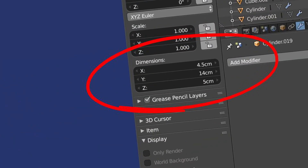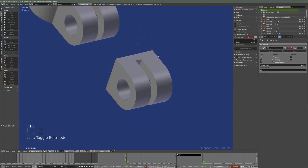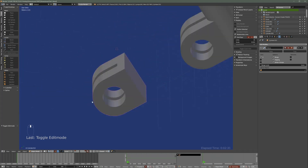I went back and double-checked in Blender — it's 140mm. And when I checked in Cura 3.6, Cura also says 140mm. So I'm not sure if it grew when Cura sliced it or during printing, but it seems to have grown by 1.5 to 2mm. I also wasn't happy with the surface finish the infill left in that hole, so I cut that little part off the back.